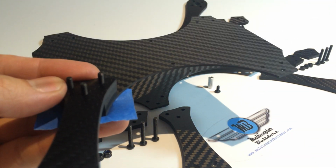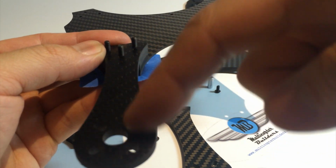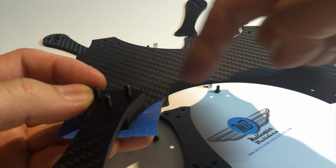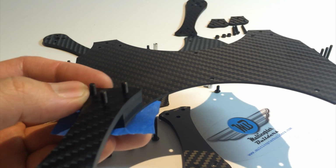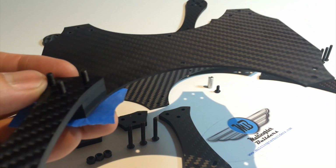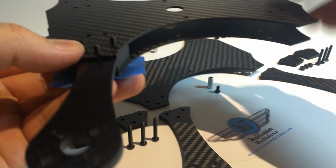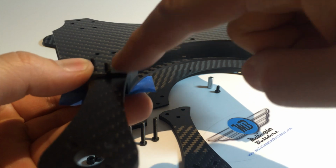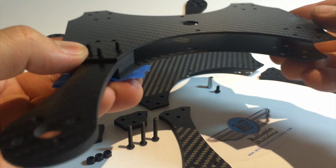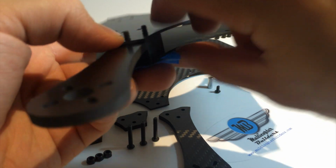So it's going to sit on the table like this with all 4 of the arms in this fashion while we mount the motor and we mount the ESCs and the power distribution block in the middle. And after that, we take the top plate and we're going to sit that on top, and we're gonna tighten down the 3 M3 lock nuts. So this is how it was designed to be built, and it's really good. The spacers act to be a really rigid platform.